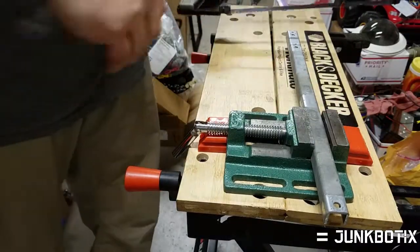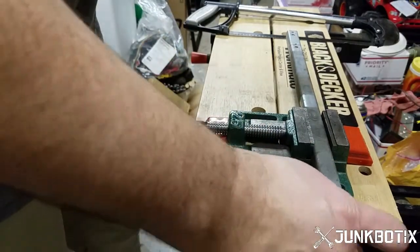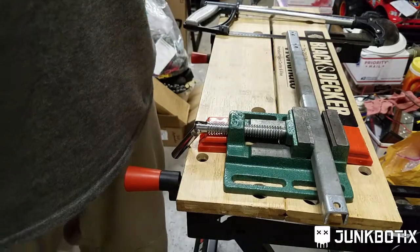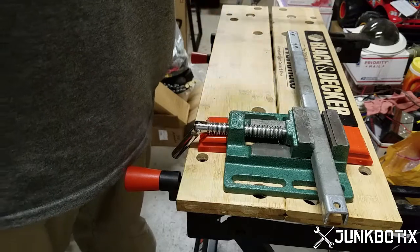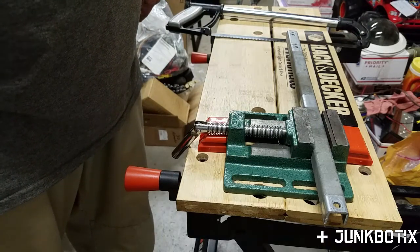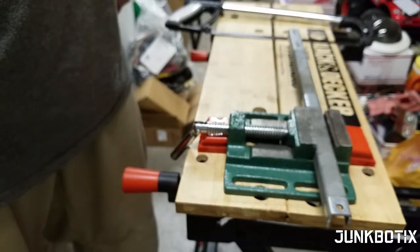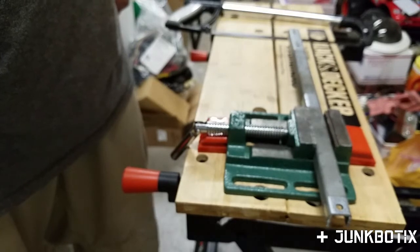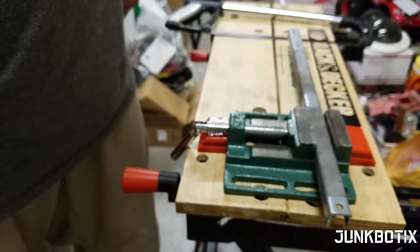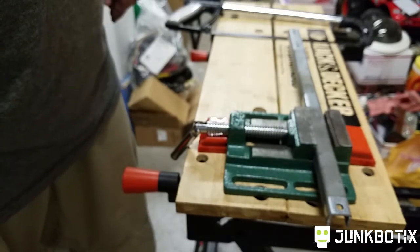There we go — that's one end. I'm just going to do the other end, and then we'll clean this thing up with a file because I like cleaning things up with a file. Makes it a little bit more professional. Another option, rather than a hacksaw, is a fine metal-cutting blade on a jigsaw — that can go through this fairly easily. Also, a Sawzall can work too. I wouldn't recommend a circular saw with an abrasive blade. There are a number of ways you can do this, but hand tools can do it too. When we get the other side done, we'll get to filing.